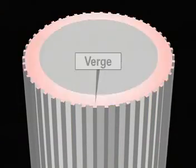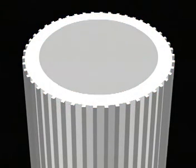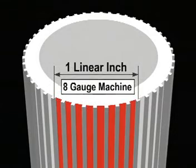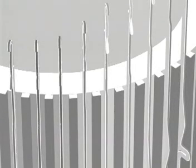The top edge of each groove is called the verge. These cylinders are very precisely manufactured, so the diameter measured at any place is equal. Machines are classified by the number of cuts per linear inch, referred to as the cut, or gauge, of the machine. For example, an 8-gauge machine has 8 cuts per inch. The total number of cuts around the circumference of the cylinder indicates the number of needles — the more needles, the wider the fabric.